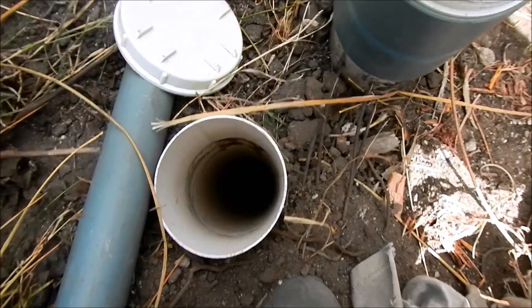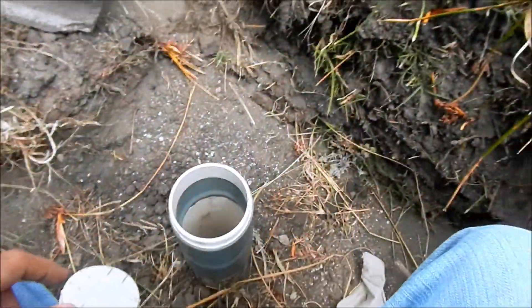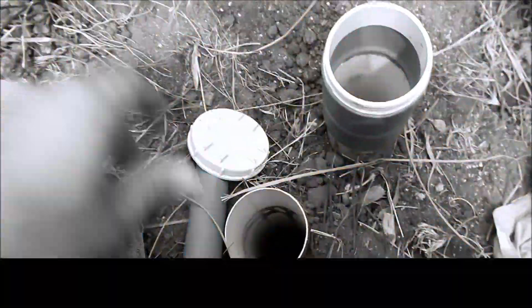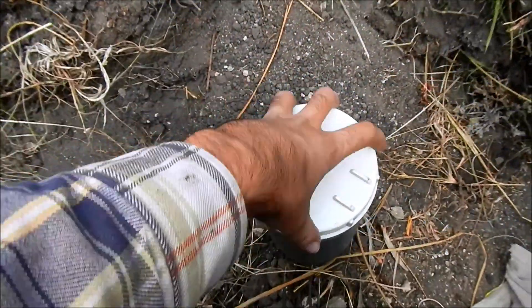Within these pipes, at the bottom of these tubes, are valves that will respectively empty the pump tank and the sedimentation tank of the pump house. These valves are located about 15 feet south of the pump house, and we're adding caps to prevent any dirt and debris from going into the piping and jamming the valves at the bottom of the pipe.